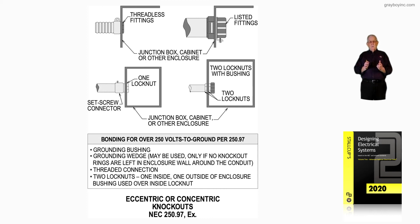Notice that as long as the voltage is 120/208, 120/240, or 120 volts, we do not need to bond around this equipment. It is only when it is 277/480 volts that you really want to look at NEC 250.97 as well as the exception. That is what figure 16-101 is illustrating.